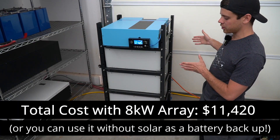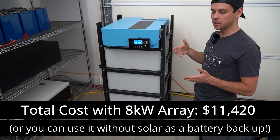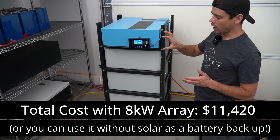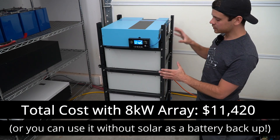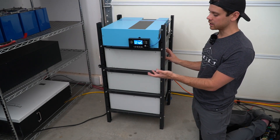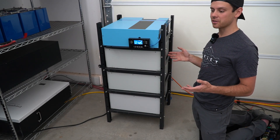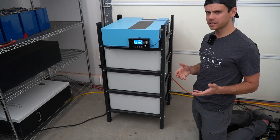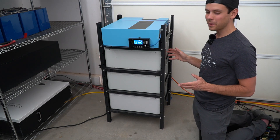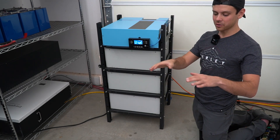Personally I think I would go with a double stack — you'd have 30 kilowatt hours and a 240-volt output, so you can actually use it with a transfer switch to back up your whole house, and the system would be completely off-grid. Unlike a Tesla Powerwall you do not need a wi-fi connection or any communication connection — this is a standalone unit that you can run for as long as you want. The batteries are lithium iron phosphate, whereas the Tesla Powerwall and most others are using NMC because they're cheaper to make at scale. Tesla says they're supposed to switch to lithium iron phosphate for household storage units in the future, but that will make them very heavy so it might end up as a floor unit rather than a wall unit.